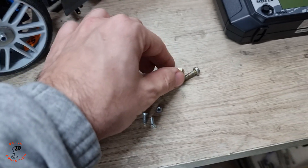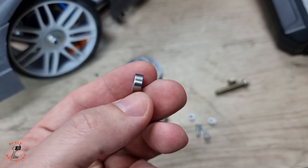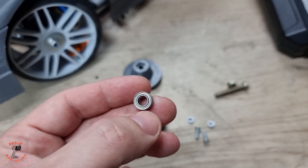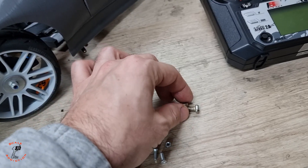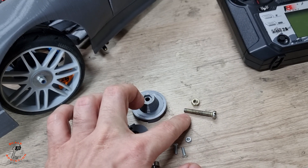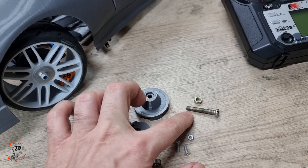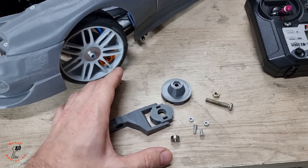The nuts will be inserted here, and one bearing — this bearing is 10mm by 4mm by 5mm. The insert and the clutch will be connected with one M5 bolt; the nut goes in there. The other end will connect to the drive shaft, or maybe I will connect it directly to the manual transmission.